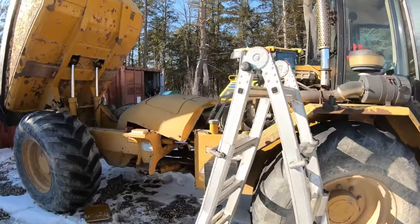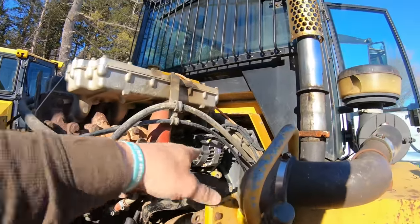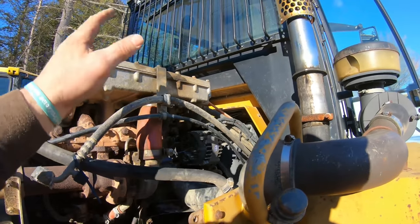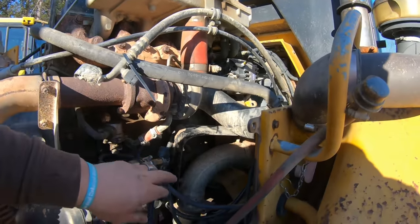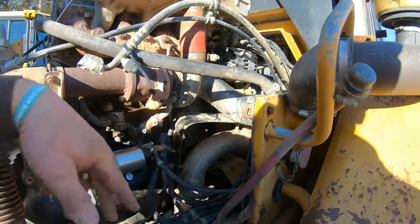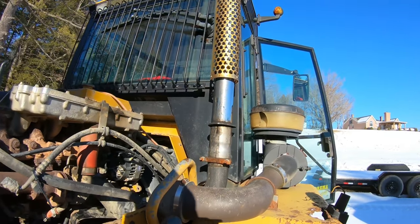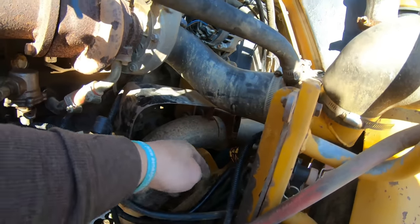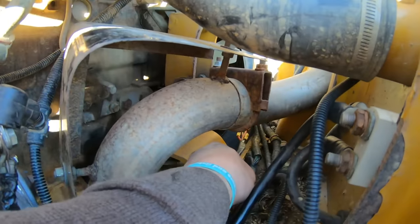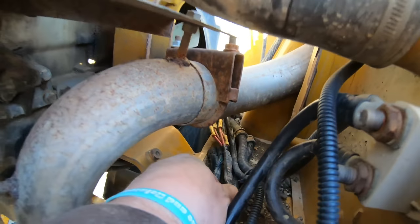All right. So after poking and prying, and I checked all these wires and I actually disconnected them and it still started up and everything. So it's nothing to do with that. It's this wire I traced back, which would be the key switch wire. I mean, it could be in the key switch itself. Maybe I'll order a new key switch. But then I started following this wire back and I found some gangster stuff. I mean, we're straight out gangster right there. Look at all those splices.